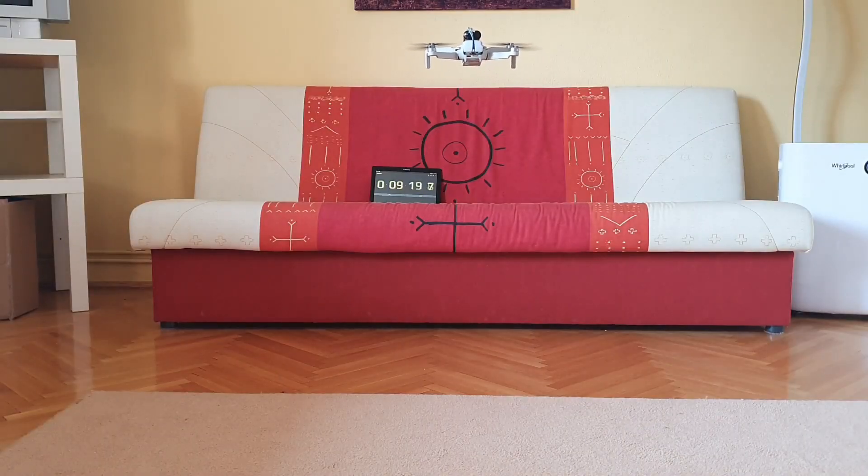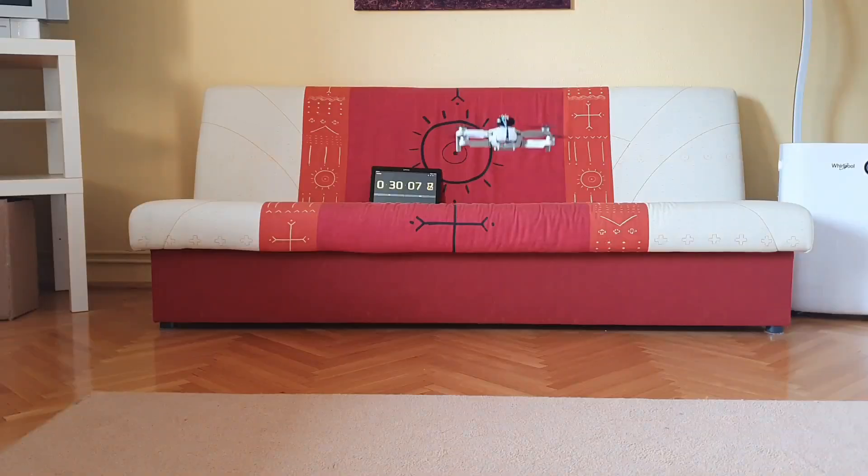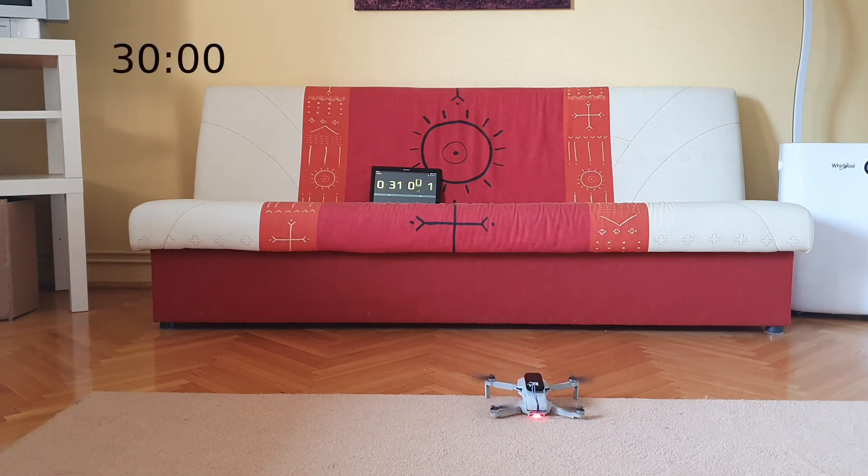I show the phone display quite often — you can slow down or pause the video. What I noticed is that the countdown timer to forced auto-landing and battery depletion is a little bit slower, but not too much. The problem with Mini 2 batteries is that the capacity of the cells is burnt into the firmware, so both the battery and the drone count with that capacity. Increased capacity doesn't make too much of a difference — that's why I didn't change the cells. And as you can see, even with more than double the capacity, the drone only did 30 minutes of flight time, which is not too impressive.